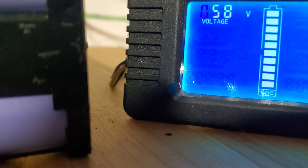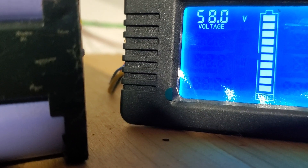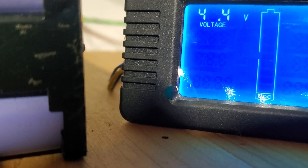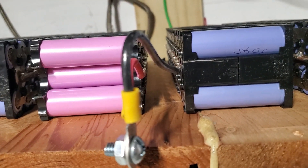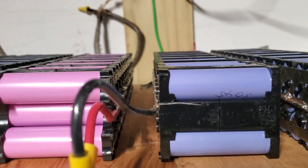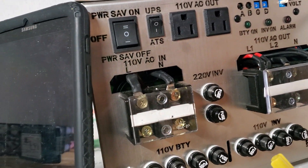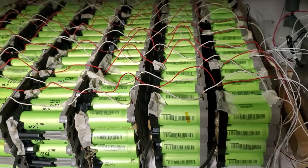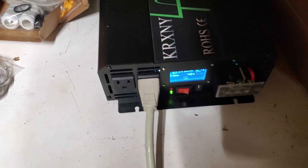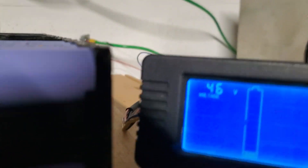We're looking for 58 — let it sit there. It's going to give you another zero because it's four digits. Now you set the lower voltage. This battery can go down to about 2.5 volts per cell, and your inverter typically cuts off around 40 volts. The lowest inverter I've ever seen is 39 volts on a 48-volt system. So let's keep the lower cutoff at 40 volts.